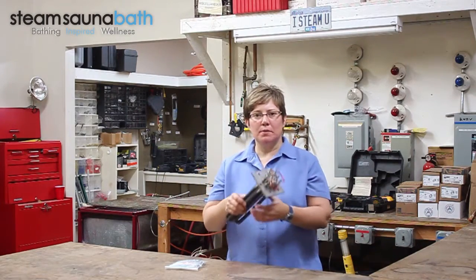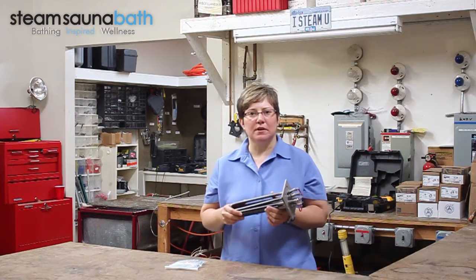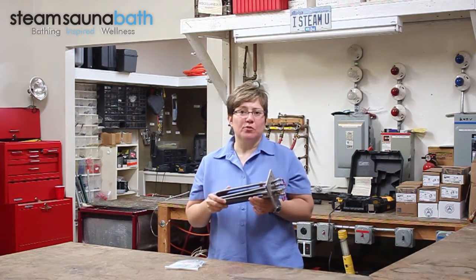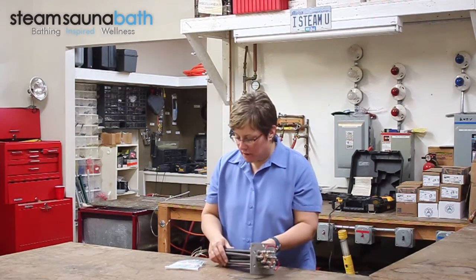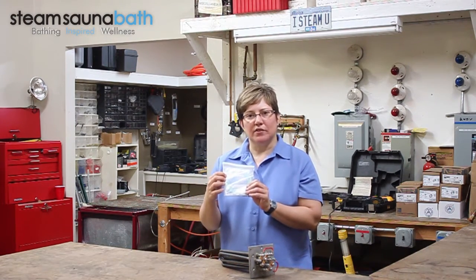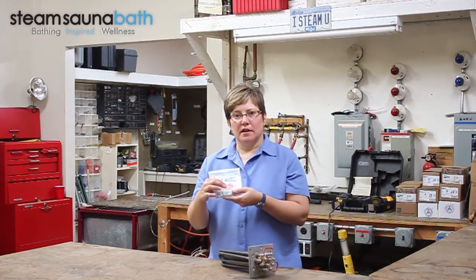The 39121B is a 12 kW, 208 volt single phase heating element which resides inside the pressurized vessel and is responsible for boiling water to create vapor. The heating element comes with an element gasket kit which consists of a green compressed non-asbestos fiber gasket, six stainless steel bolts, and thread sealant compound.